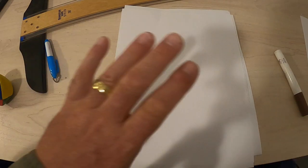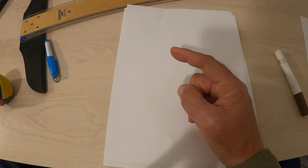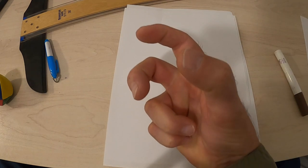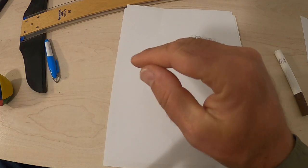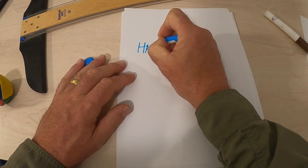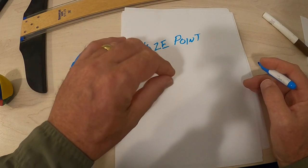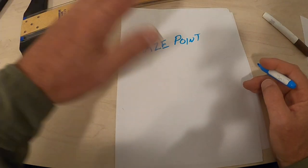And in fact, there's a science to this. Antifreeze has what's called four phases. The first phase you're familiar with, a liquid. When that liquid temperature starts to drop and drop and drop, the individual water molecules will begin to freeze, but not attached to one another, but they're frozen. That's called the haze point, H-A-Z-E, haze point. The haze point is the place where the first individual ice crystals can be observed in the liquid. No problem. The water can still move, nothing's trapped, nothing will burst your pipe.